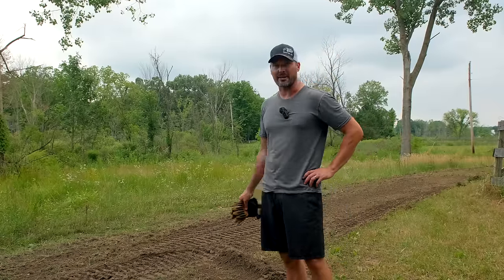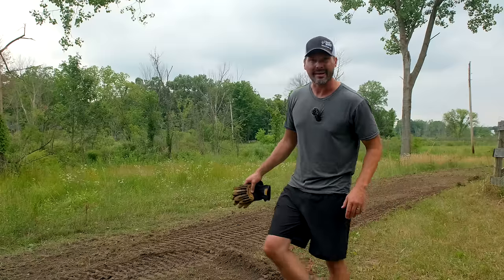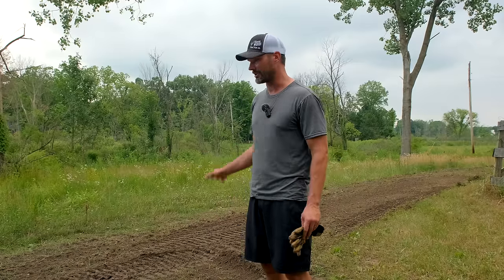It's crazy how it looks like topsoil now. So this is the kind of stuff we need to strip out, because all this has organic matter in it. It'll decompose, and if you put rock right on top of here, your gravel right on top is just gonna end up sinking down, and you're just gonna waste it. You're gonna have to do it all over again. So we wanna get this stuff stripped out before we put down our stone.